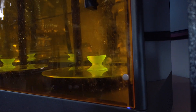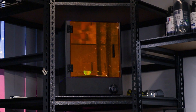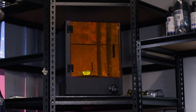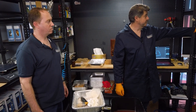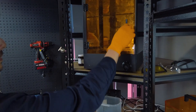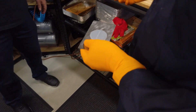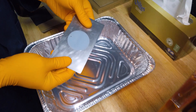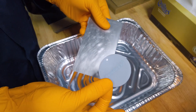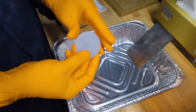This is a particularly strong curing station so it won't take very long, and it's a very thin model. I noticed you left it on the Wambam — why? If you take a model off the metal plate it can start to warp, and leaving it on the plate prevents warping during the curing process. As soon as it's cured and you take it off the plate, it will retain its shape. Looks pretty good — this is the real test, let's see if it actually pops off. Wow, no problems at all! If you wanted to, you could flip it over, put it back in the curing station, and cure the other side.